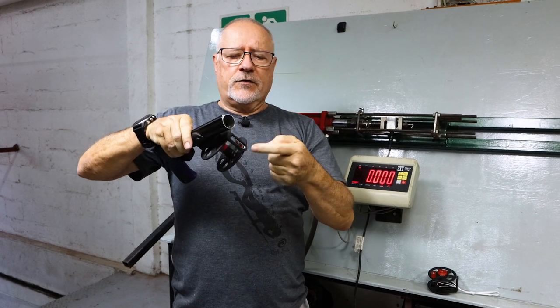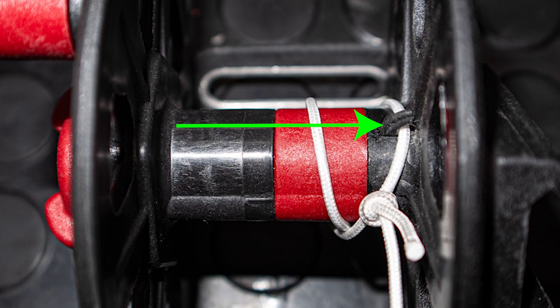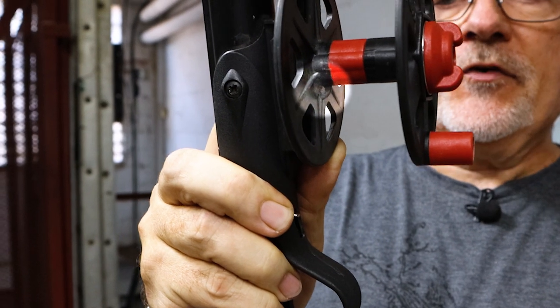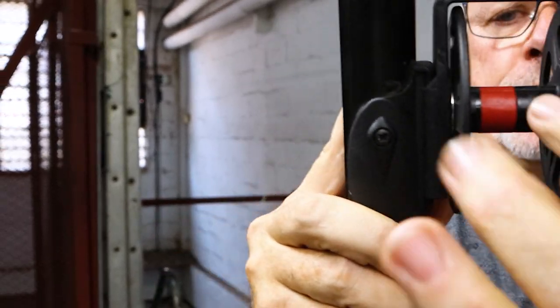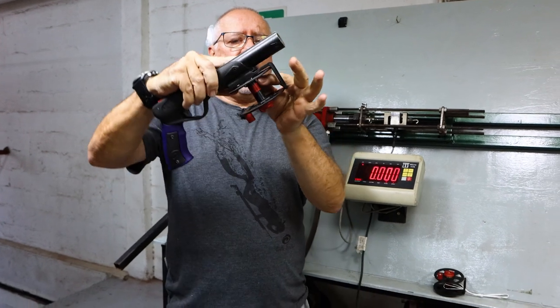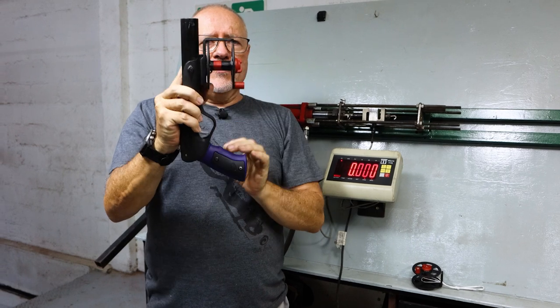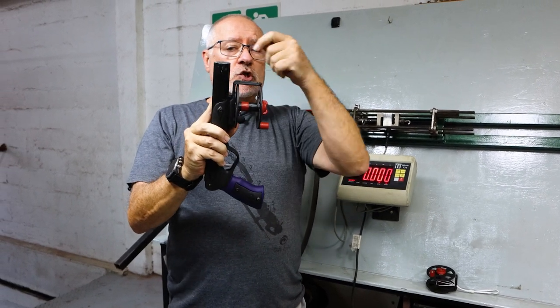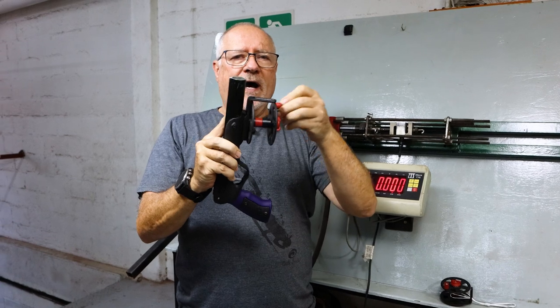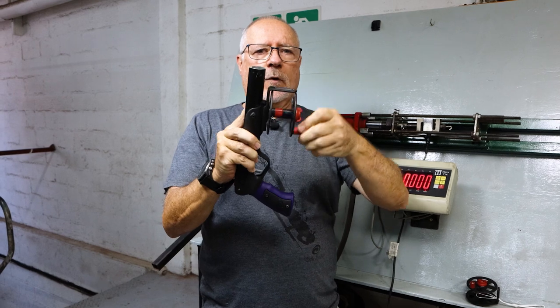It's always best to have your line feeding out through your line guard and through the muzzle eye on the reel. If you have a reel without line and you're going to install it, you'll see there's a small gusset with a hole — that's just to guide the line through, not to put tension on. Tie your knot on the other side of the spool so you're pulling on the main shaft, not on that little gusset. The gusset stops it spinning while you're winding, so once you've tied your knot, pull some tension to lock it and wind your line up.